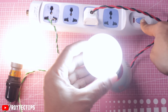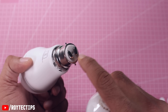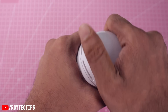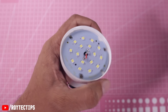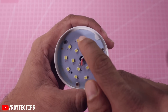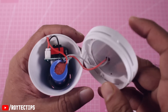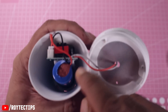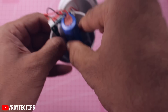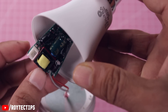As soon as I turn off the light, the other light turns on. If you have a power problem, you can use this as an emergency light — you can use it outside anywhere. This bulb is powered by a battery. Now let's open the bulb. Inside the bulb you'll find around 15 LEDs, all connected in parallel. Beside those LEDs you'll find a proper power supply and a lithium-ion battery attached inside using a dual-sided tape. Let's remove the tape.